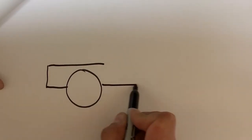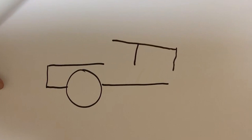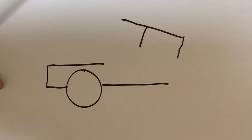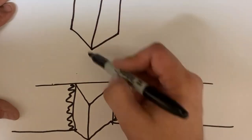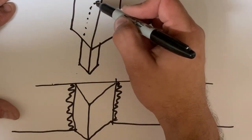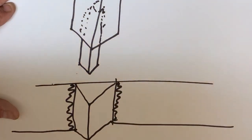To do that, all we're going to do is cut three spots right there, then pull that side piece out and re-weld it later. The side piece here is a piece of angle iron. We're going to cut it and re-weld a smaller piece of angle iron inside of it so that way when it sits down inside it's nice and snug.